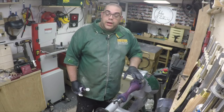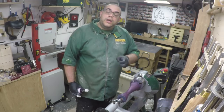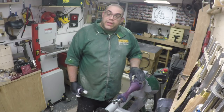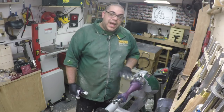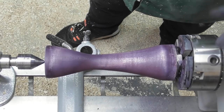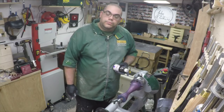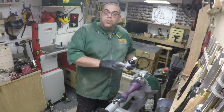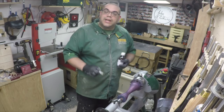Now I'm going to take some purple and colour the whole thing with that. The black was applied with tissue, and for the purple I had the lathe spinning and just sprayed it on to get a really good even coat. I left that to dry and then sanded back — not as much as I sanded back with the black — but sanded back the purple, which revealed some more of the lighter wood again. Then I'm going to use some of the Crimson colours — the Intrinsic purple — the Intrinsic purple is a lot darker than the Crimson purple, so that gives me a little bit of layering and just helps give a little bit of extra character to the wood.